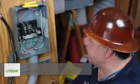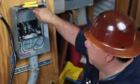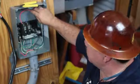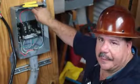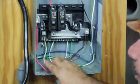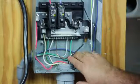And today, I'd like to talk to you about how to coil your electrical wires. Now, what this really is talking about is bend radius. Now, the National Electrical Code gives us as electricians a certain amount that they will accept. The reason that they do this is because if your bend radius is too sharp on your electrical wires, it can cause a breakdown in the wire eventually.